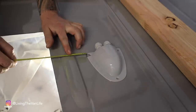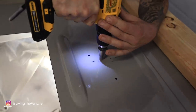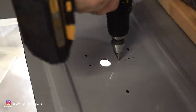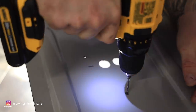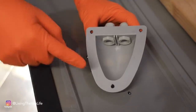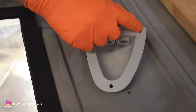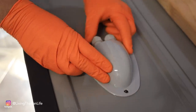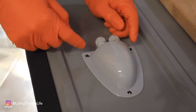Basically what we're going to do is drill two holes up through the ceiling, glue this down over the top, seal it all off, and then when we install wires these connections right here seal up around the wires and make a very nice tight waterproof and weatherproof seal. Before I install this to the roof of the van I'm going to take some 3M 5200 sealant adhesive and run a bead of that around here, set this down, and then go ahead and screw that in. I did go ahead and pre-drill my holes where the screws are going to go.